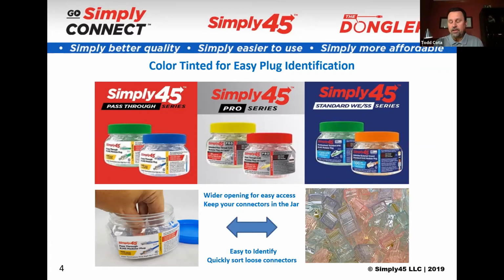Most every other connector manufacturer out there is all clear. So if you have these different category type connectors, they get mixed up, and now you've got a different problem on your hands. We realized this was a really good call to action. If you see the blue connectors, those are Cat 5. You see green connectors, they're Cat 6. If you see red connectors, they're the hybrid Cat 6, 6A. And then the green, orange, and yellow ones are the 7 and 7A connectors. So there's a meaning behind our color scheme.